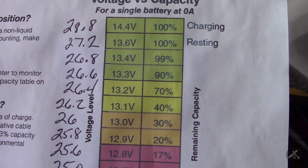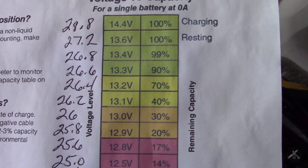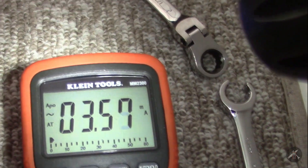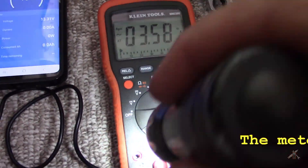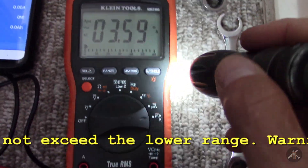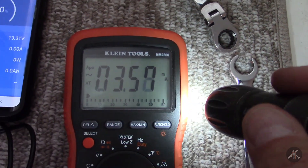Normally I'd let this go down and down, but my goal right now is to check this, look for parasitics, take it back to the top, and make sure the motor is unplugged every time when I park it to see if I can correct my issue. What I've done is disconnected the negative side from the first battery and connected my ammeter in between. You need to be really careful — you need a digital voltmeter/ammeter combo that will read the amount of current you're expecting. I tried the 10-amp range first to make sure we were okay, then moved to the 400-milliamp range. At the moment, with the monitor reading the Bluetooth signal and transmitting, I've got about 3.5 milliamps.